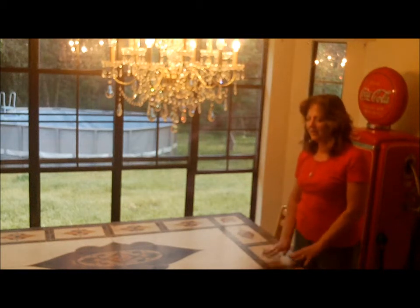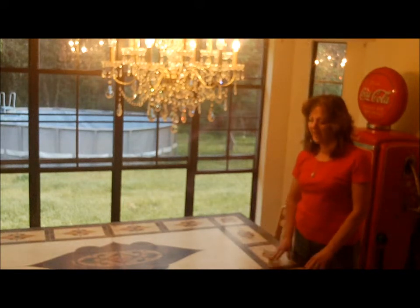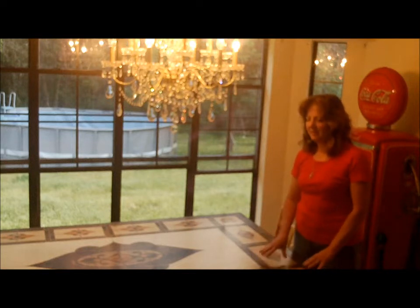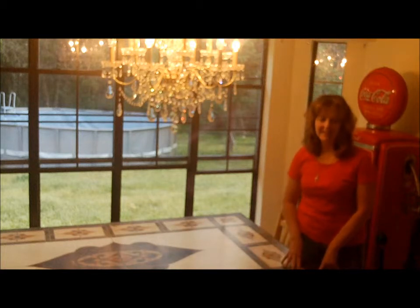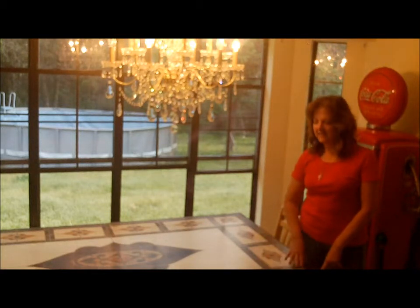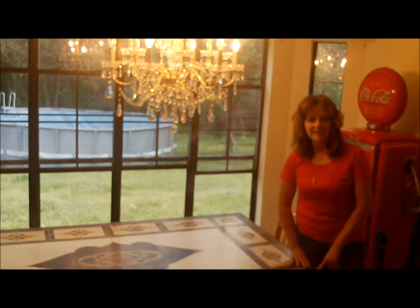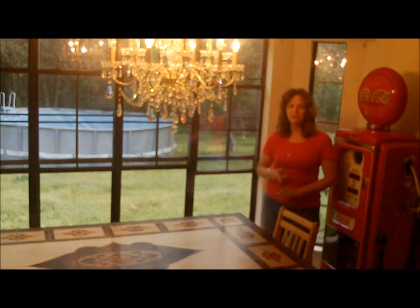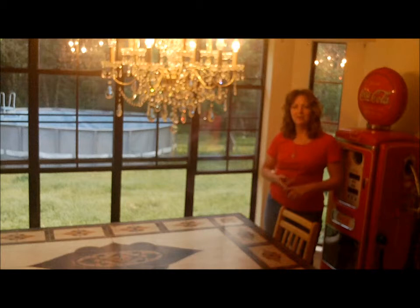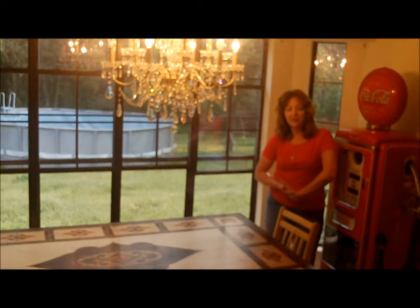So I got a good quality finished piece of plywood and laid out a stained glass window pattern. I made my own patterns and laid them out on the table, traced the patterns, and then used different colors and kinds of wood stain and stained the pattern onto the table. Then I lacquered over it — and this is the finished product and I want to teach you how to make it. I've done the same thing on a door, on a bridge that my son assembled, and on the floor in my old house. I stained the shape of Texas on the floor in a stained glass window pattern, and it all turned out real good.